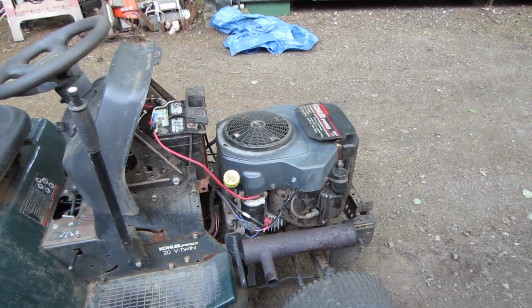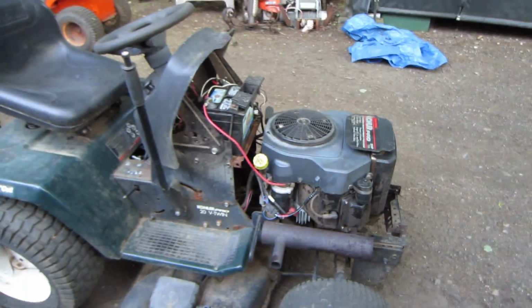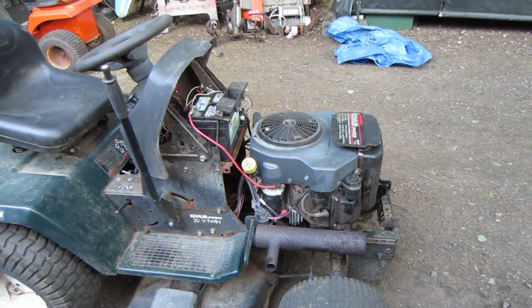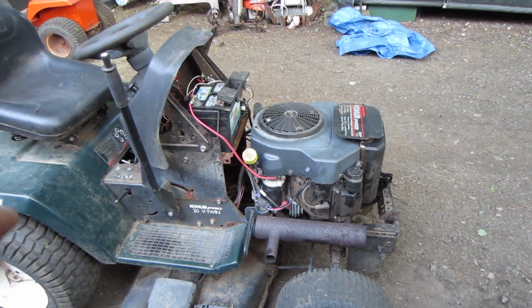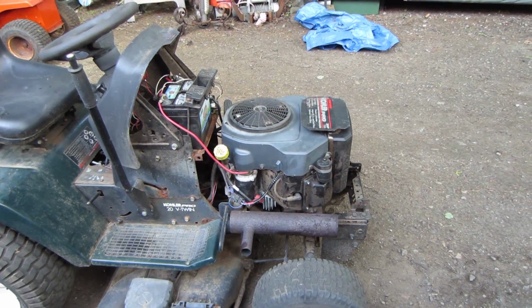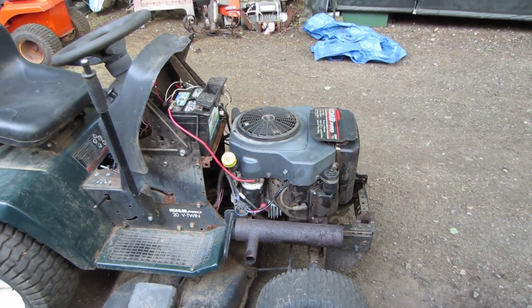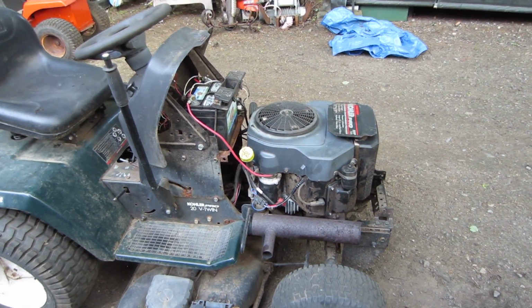Now when you rev it up, it's fine. The real test is going to be when it's cold again. I fire it up and see if it's real tappy when it's cold. And the other last thing is still, the oil looked fairly clean in it, but if I change it and change the filter, I'm sure it would also help the oil pressure, and the oil pressure is what pumps up the lifters too. So I think it's pretty good.